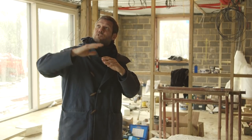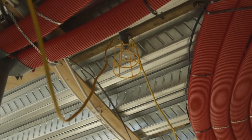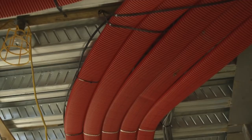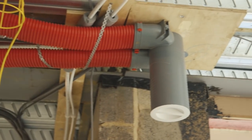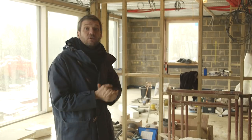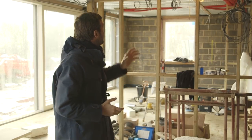The building is designed with a suspended ceiling, so all of the services — you can see hot and cold supply for the kitchen, first fix electric cabling, and the red ducts — all of that will be hidden behind the suspended ceiling. It just means we've got really good access to get all the smart parts of the building in without threading them around too much structure. The main reason we went for that system was for the distribution of the MVHR.